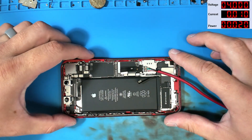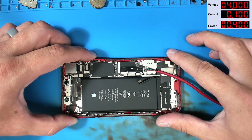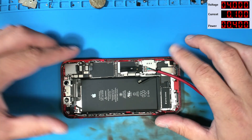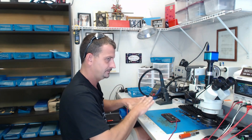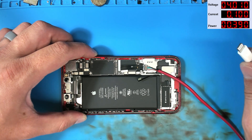We're going to press the button to boot — one, two, three, boots. We are drawing 80 milliamps of current, then 160 milliamps, and we have dropped back to 100 milliamps. That is not a normal boot sequence. This phone just came up to 100 milliamps and stalled — not a no image issue. I'm starting to think this thing is probably in DFU mode.